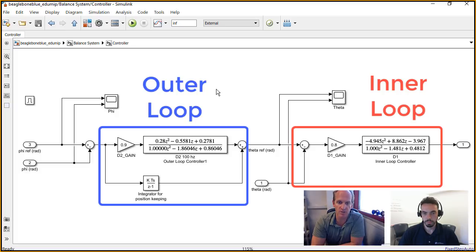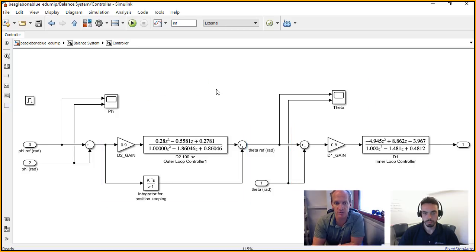These are two discrete-time controllers developed in MATLAB in continuous time, and then ported over to discrete time using Tustin's approximation. What's nice about this is that if you want to change your controller in MATLAB, you're able to come here and simulate, just type in the numbers, change your gains, do more fine-tuning, and actually see the performance on the robot immediately — rather than having to hard-code it in C, recompile it, move it over to the robot, and hope you don't drive it off the table.